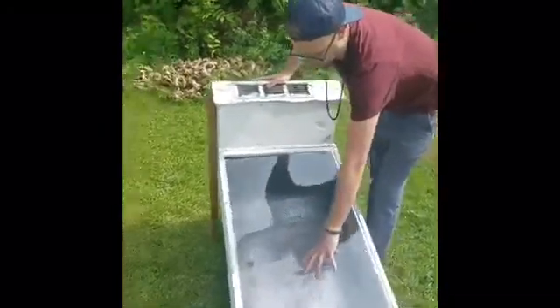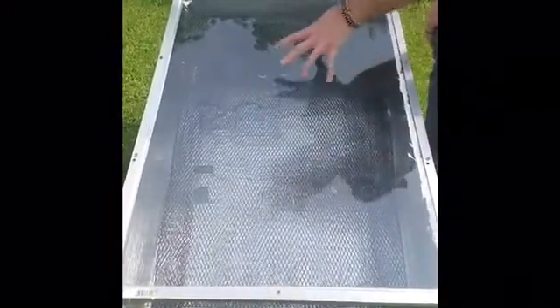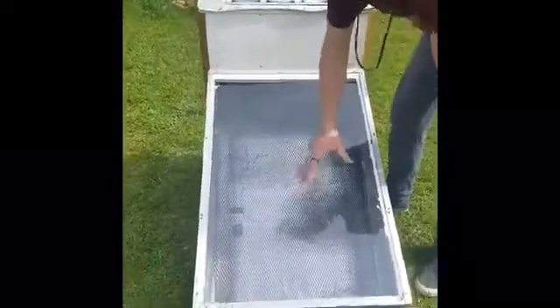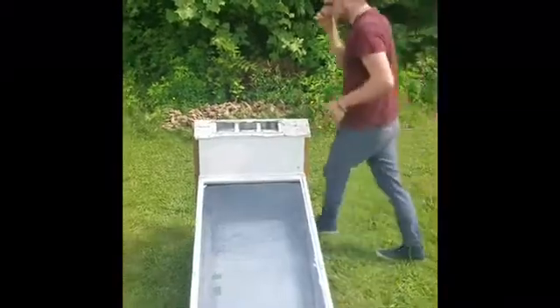— this black metal material right here is a heat absorber. I painted it black, and what that does is as the sun comes in, there's insulation to keep the heat in that's reflective, and it reflects back onto this heat absorber. It's actually very hot right now — if I put my hand on it, it's pretty hot. It allows you to keep the heat in as long as possible as you're collecting it, because otherwise it radiates back out.